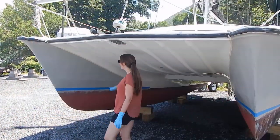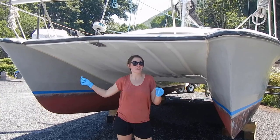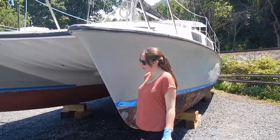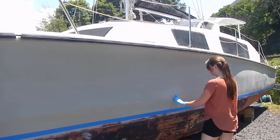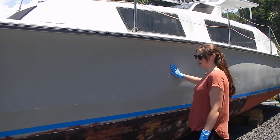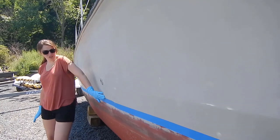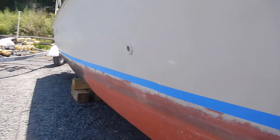We're not painting the whole boat underneath, so we taped off where we think a good line would be visually. We also taped off a 2-inch mark — we're going to have a white stripe, and that goes down both sides of the hull. There are a few high spots we found on the boat which is why it looks like there are some white marks, but if you run your hands down it it's pretty smooth, so we're not too worried about it. The boat has a bulkhead right here, which is why you can see this crazy dip — it is what it is. Luckily when the boat's in the water you'll probably never notice.